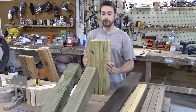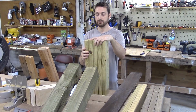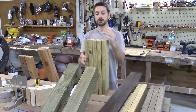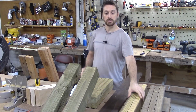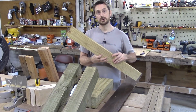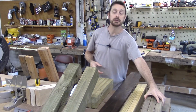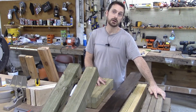We've got 5 1x7s. They're 1 foot 7-inch 2x4s. These are all treated for the bottom portion. We've got 2 2x4s that are 2 foot 8 inches long, and then another 3. The 2 on the bottom are going to be treated. The other 3 are not treated.